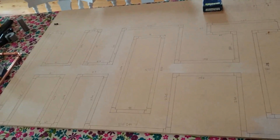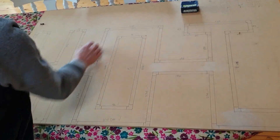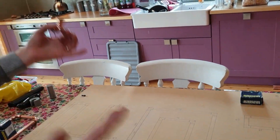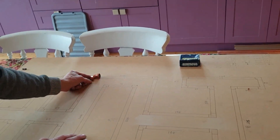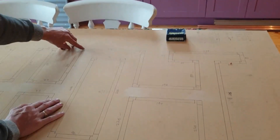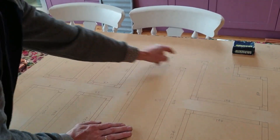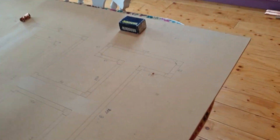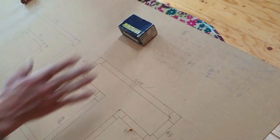So that is called a rod — you draw out a rod first. As you can see, I've drawn in my elbows and how far my pipes come to the start of an elbow. This is an elbow here; it's a one-way push fit, so if you get it wrong you might as well chuck it away and start again because you can't pull the pipe back out. I've taken into account that my pipe will go in 15mm, so my pipe will stop there in line with that line. That's why I've drawn my lines in here — 22mm from the edge — giving me my shoulder edges, which I've then drawn on the board. All the sizes of every piece of copper. I did a little rough cutting list: 6 at 43mm, 2 at 69mm, big ones 1 at 476mm, etc.